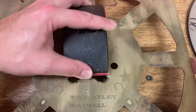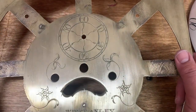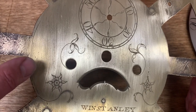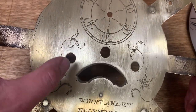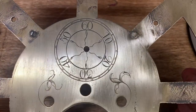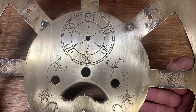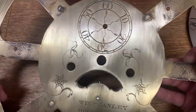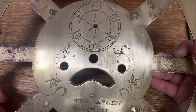This is moderately forgiving when we do our final grain pass — that'll be coarser than this. I'm more concerned with getting all the way through the tarnish, because if we don't, the silvering won't stick there. The chemical reaction will be inhibited by the oxidized brass. You can tell how you're doing: if the brass is yellowed, that is too oxidized and the silvering process isn't going to take there. Where it's shinier and brighter, that's where it's going to work. You can make a determination on how much patina you want to show through your silvering. Right now, darker lines would show through. If you want it more pristine looking, you can keep sanding. In my case, I'm going to go a little farther to get rid of the remaining tarnished areas.